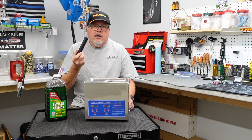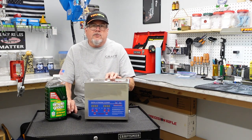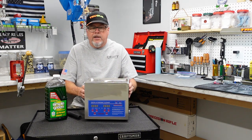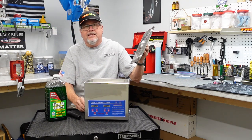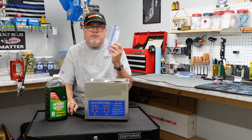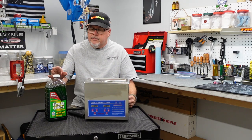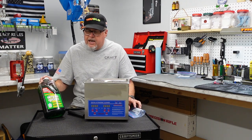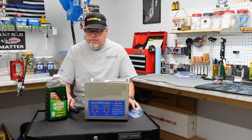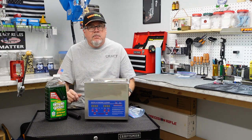So it's probably due for a cleaning here. We want to take it apart and get her all cleaned up. What we're going to be using is my little ultrasonic cleaner here — just one I got for Christmas off of Amazon. It's 3.2 liters, filled up with distilled water. We're going to take our Thunderbeast apart, take all the components, put them in a Ziploc bag, and fill it with Simple Green at 100% concentrate. This is not the heavy-duty stuff, so we're going to see what kind of job it does.